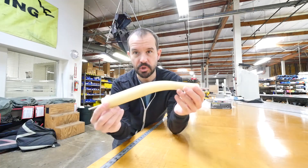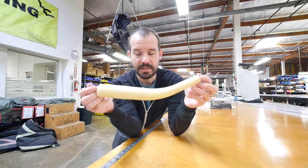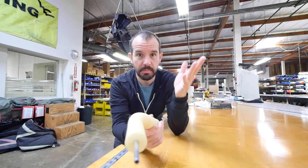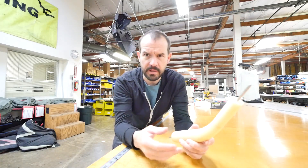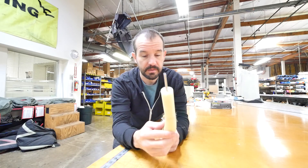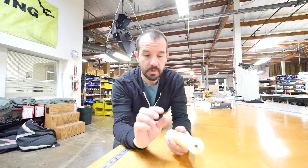This mandrel will be trapped inside, but what's neat is it's made of a material called polyvinyl alcohol, or PVA — basically the same thing as Elmer's glue or white glue — so it dissolves in water. Once the part is cured, you soak it in water, scrub the inside a little, and it comes out leaving a hollow part with a good thick solid wall.